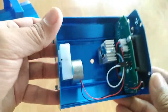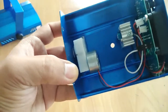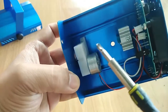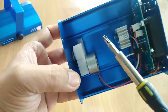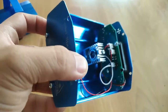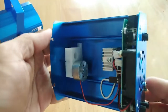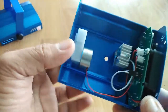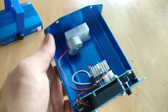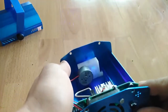We will dismantle the two laser modules with the mirror very quickly here, then show you what changes I have made inside. As you can see, I replaced the green module with a 405 nanometer — they just call it purple or blu-ray laser. The power output of this purple laser module is only 50 milliwatts running at about 50 to 60 milliamps. We can't see the actual output very well if we point it at non-luminous objects, but in total darkness you will notice the effects that we will show you later.